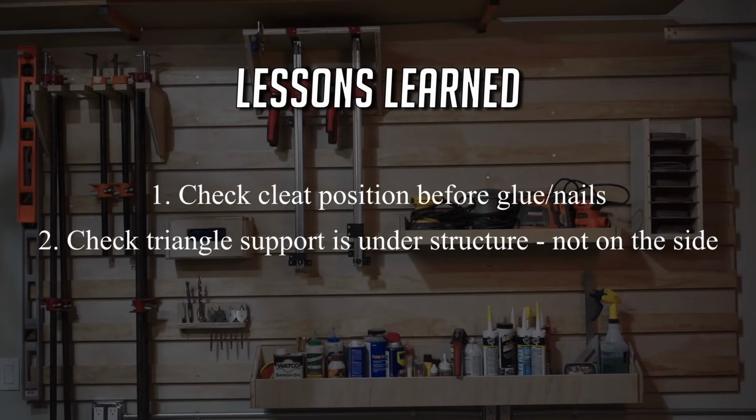Number two is check your triangle support, that it's under the structure on a tool holder rather than on the side. Specifically, I'm talking about the clamp racks. The first time I built one, I put the triangle support on the side of the tool holder rather than under the structural support. And really, you're losing a lot of the strength when it's attached to the side rather than underneath.